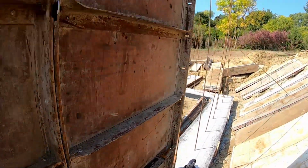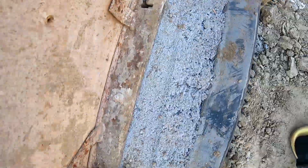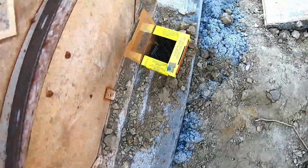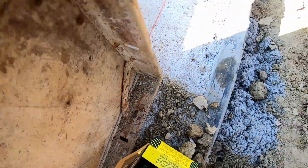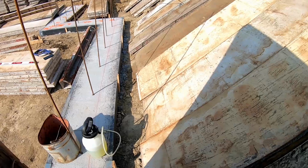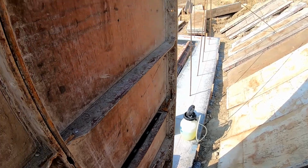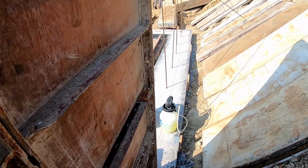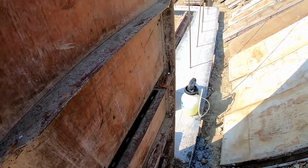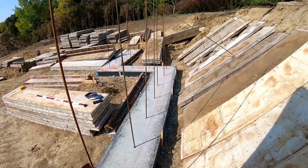I've also discovered on the bottom here, rather than put the concrete nail in the middle in that big old slot, there are smaller holes on the edges. So just one in each panel. Right there, right there. And then there's one over here as well. And that way there's no movement whatsoever. So also, instead of trying to hang on to pins and ties and wedges while I'm setting the next panel, I've since laid out what I need on the form previously installed. That way it's easily accessible once I set the panel up to just grab and slide in.